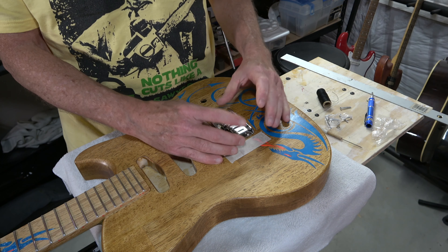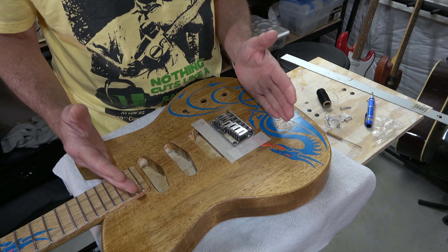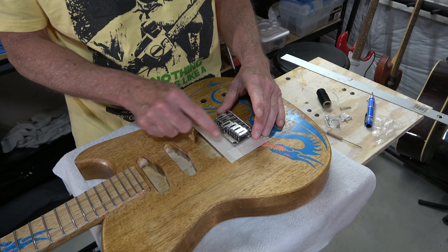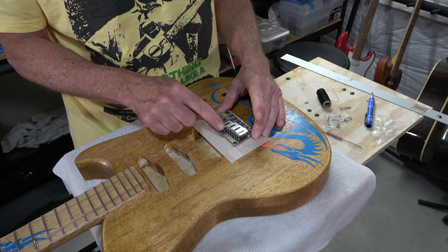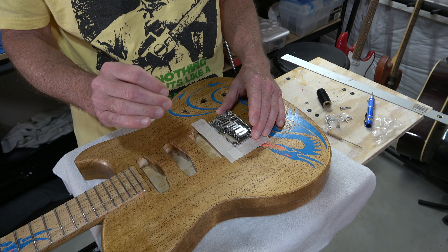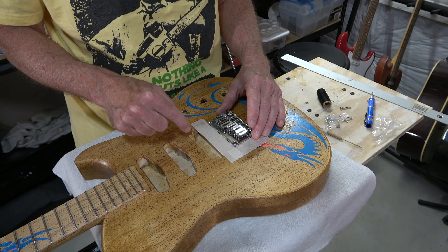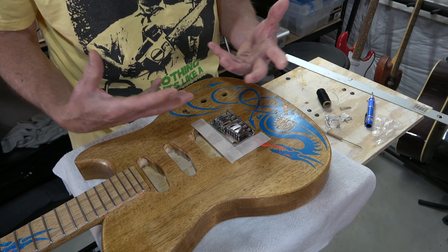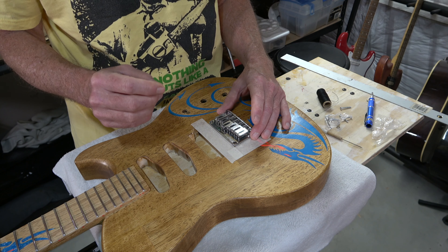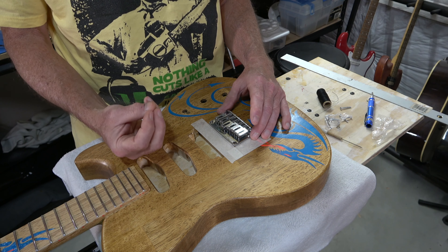What that does is ground not only the bridge but the strings, which are in contact with it. Technically the bridge and strings aren't really part of the electrical circuit — however the strings arguably are, because they're steel and they pass through the magnetic field generated by the pickups. The strings themselves become slightly magnetized. When you pluck the string, it vibrates, exciting the magnetic field, which causes electrons within the copper coil of the pickups to start moving — and that is your electrical signal.